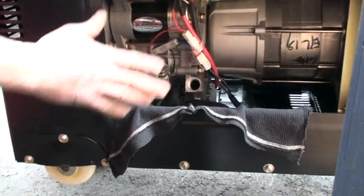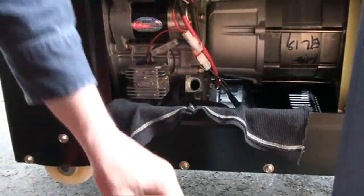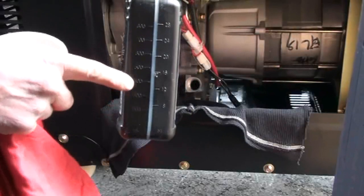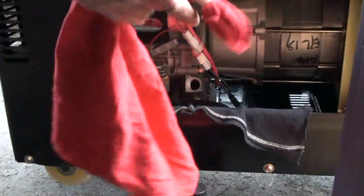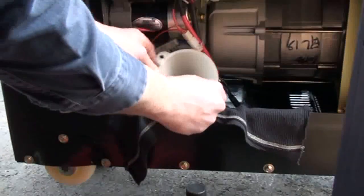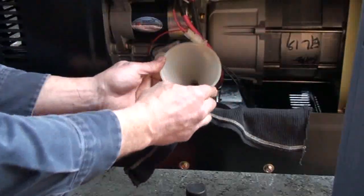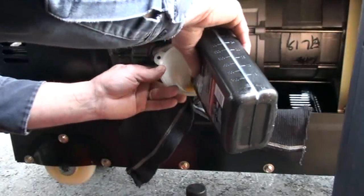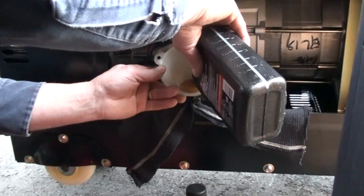Here we are on the back side with the big panel off. We're going to put in 1.65 liters of synthetic oil. We'll pour one full liter in, then measure out the remaining 0.65 liters from the second bottle. Make sure your funnel is clean so you don't contaminate the oil. It's a bit of a tight angle, so we can't just glug this stuff in — we have to pour it in carefully.